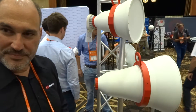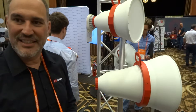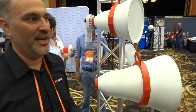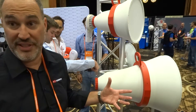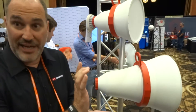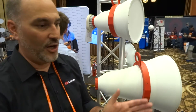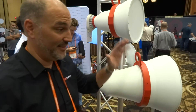I've noticed that on your standard horns, on the really wide one there was a tiny little side lobe, but once you got down to that 30-degree, there was absolutely nothing. And now you're down to 11 — so you're not going to hear a damn thing that's not in front of it. Pretty much. If you look at the parabolic antenna, it's really old technology. Side lobes are huge on those antennas and people are using shrouds. The shrouds help some because there are real vertical side lobes, but there are two extra side lobes on every parabolic antenna that are actually pretty flat and they go straight through the shroud with the main beam — and those are like 30 degrees. So you think you're getting a 10 or 8-degree beam angle, but it's really more like 30. This is 11 — done.